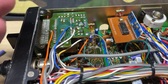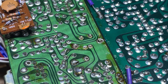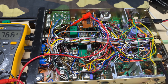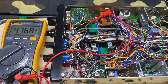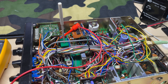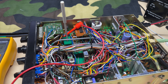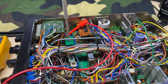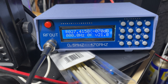Now I bought this radio to be modified, so eventually the green VCO will be coming out. But for testing purposes we're just going to drop in a known working green VCO. We're back on the test point again, and the fault has reappeared. So it doesn't look like it's the VCO that's the problem.